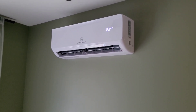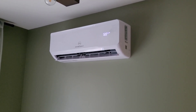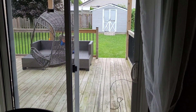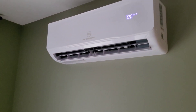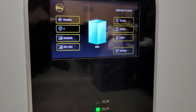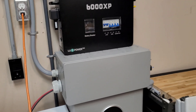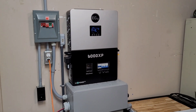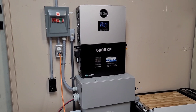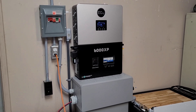It's 8 AM and everything worked well through the night. It's about 71 degrees in the house currently. Looking at the app, this thing actually turned itself off just before midnight and did not run the rest of the night — it ended up cooling off pretty good. On the battery, we're sitting at 86%, so we only used 14% to get through the night. That's about two kilowatt hours. So you could get through the night on two 100 amp hour lithium phosphate batteries, or something like a Bluetti AC200L — one of those 2000 watt hour power stations — as long as the temperature is not too hot. Being an inverter compressor, this thing ramps up the higher the demand, so last night was a pretty light night — probably worth testing again in the future.